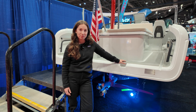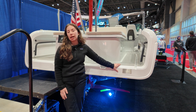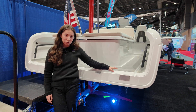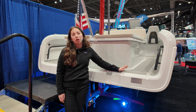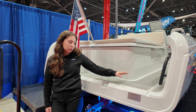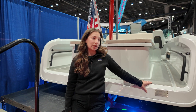We did a test on if you had quick charging infrastructure, how far could you get. The idea behind that is we would run the boat for about an hour and a half, plug it in on a quick charger for 15 minutes, and run the boat for another hour and a half. We did that for a full 24 hours and we did about 420 nautical miles. People have a lot of range anxiety with something that's electric, but as infrastructure catches up, we'll be able to get pretty far. This boat charges on either a traditional shore power 30 amp, 50 amp, or a DC quick charger, so you can work with current or future infrastructure.